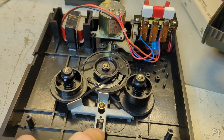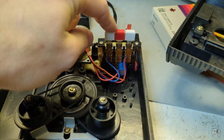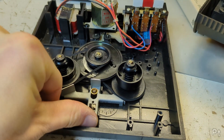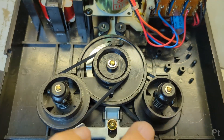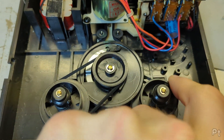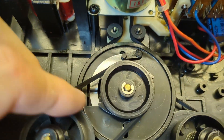This accomplishes the same thing because there's no mechanical linkage to the stop button from stop-eject. So if I go here and hit stop-eject, it does exactly the same thing. This is just a clever little way of having this control these without a pendulum gear.